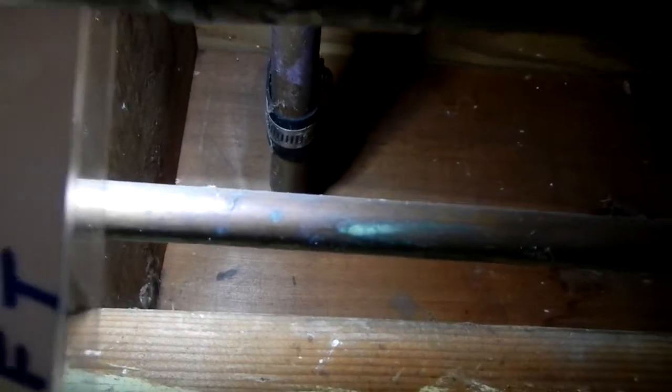Here you see the pipe — the copper pipe coming out of my box sill from the outside — comes into the house. Then I have it up on a brass hanger between the joist, anchored to that, and it's up on an angle so that the pipe is angled down to the outside. That way you get a good flow of water and it will drain that copper pipe. Attached to that copper pipe going to the outside is that six-foot washer hose I talked about, and I just loop it around inside a floor joist and return it to a shutoff valve.